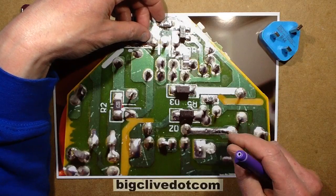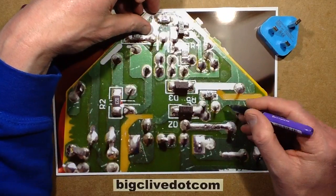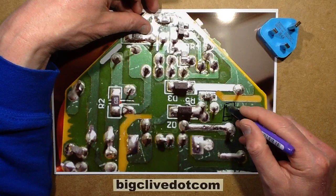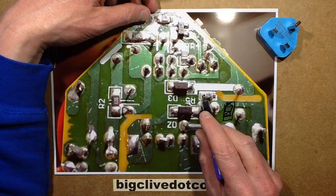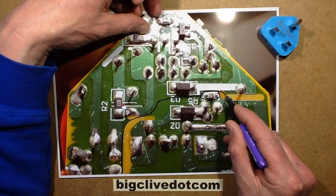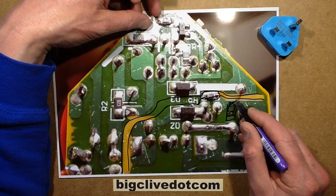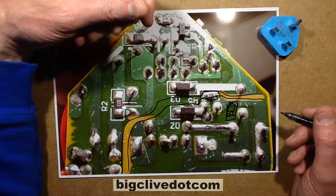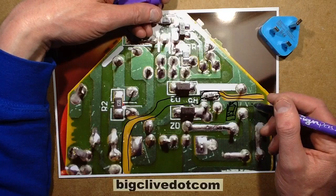Part of the circuitry here — the usual suspect — is the opto-isolator, but for no good reason this little resistor is placed across the opto-isolator right in the clearance zone. They could have mounted that little resistor down here instead; there's plenty of room and it's tiny. That would have kept the separation, but instead they just mounted it in the clearance zone.